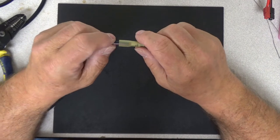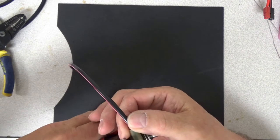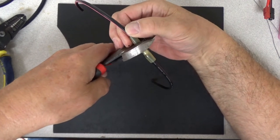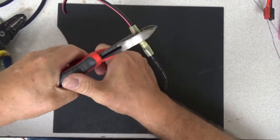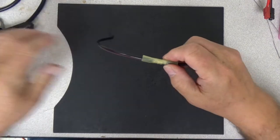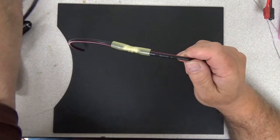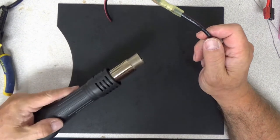I'm going to do what's called a no-no — I am going to use my crimping tool here, which is basically designed for non-insulated connections. But it does a better job crimping, and to be honest with you, it doesn't damage the heat shrink. That's the most important part — you don't want to damage the insulation. And since all that's holding this together is the crimps, you want to be reasonably careful to get a really good, tight connection. We're going to lightly inspect this, because a lot of what's going to hold this together is going to be the heat shrink.